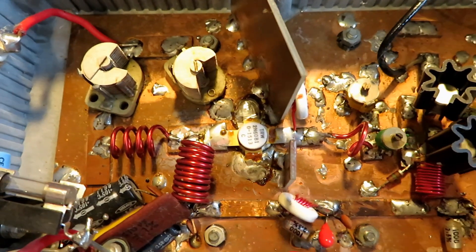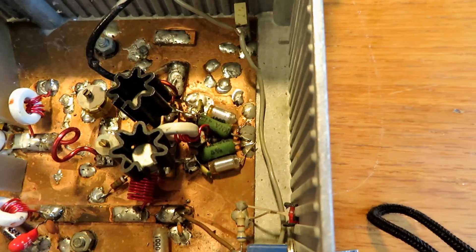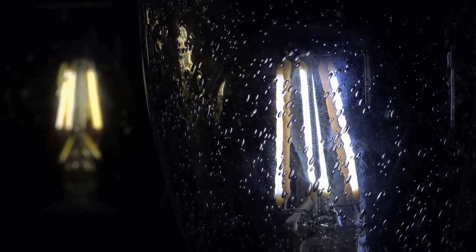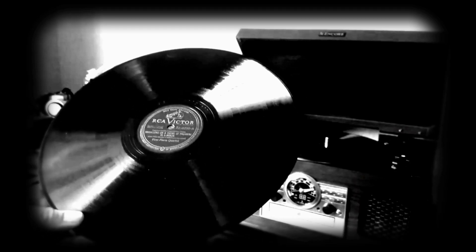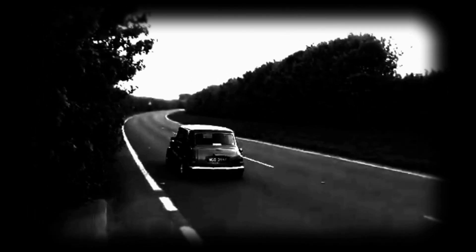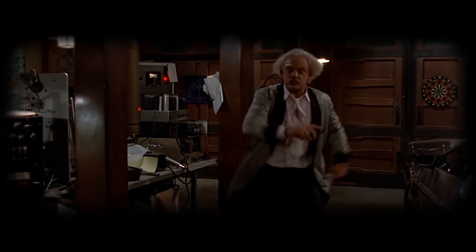Armed with my shiny copper-clad power transistor, I zoomed back to Arthur's. He had pretty much prepped the area and the transistor was soldered into place. Wanting a visual gauge, Arthur connected a big resistor and a light bulb to the output of the amp. The power switch was thrown and the bulb lit - not brightly, but it lit. Then Arthur adjusted the trimmers all through the preamp and the power amp, and each time the bulb got brighter and brighter. He disconnected the bulb, connected up the dipole, put on the old rock and roll record and I disappeared into the night. The signal was far stronger now - no fading, no dropout. This crackly old 78 tune accompanied me the full 8 miles back to my house. I was so excited that I called Arthur up to tell him. I then listened on for a few seconds until there was a dull crack and the music vanished, replaced by whispering static. How amazing was that?